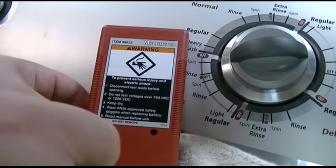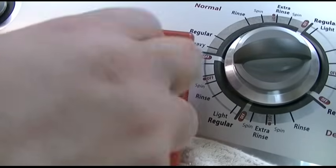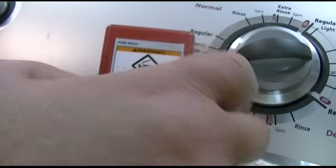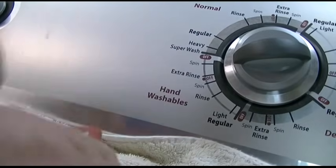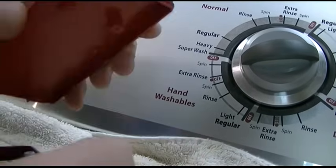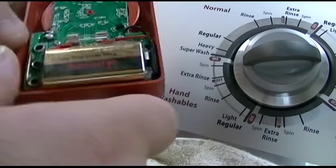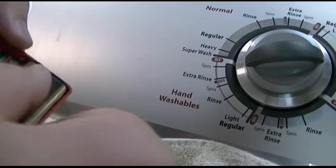Here's the back of it. There are two screws that you have to take out over here — just two little Phillips screws. This is also how you change the battery in this unit. I've also read that the readings become erroneous should the internal battery voltage become low. Once you take the screws out, you just kind of pry it apart, and you're left with a cheap China 9-volt battery made by Jingdi.